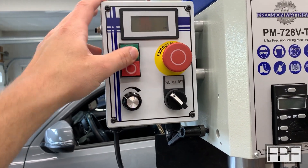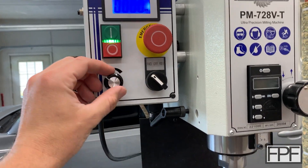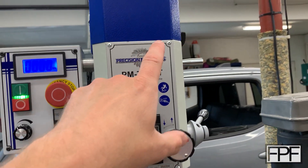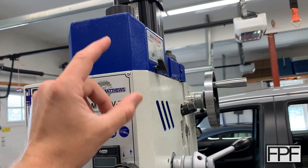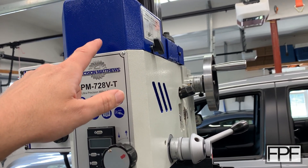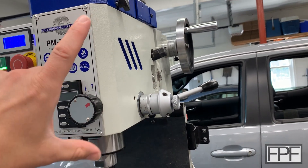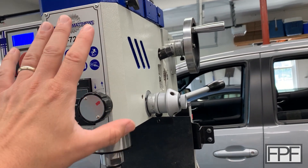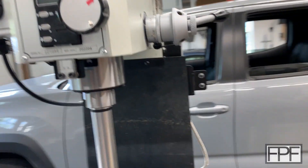We'll close this so the safety disengages and get this to just barely turn. Worth noting that any inaccuracy in the dimensions of the pulley, or if the belt has a spot where it's bent a little bit, could be pulling on the spindle and causing inaccuracy. But I can't think of another way to turn this — even turning by hand puts more force on the head versus any inaccuracy caused by the belt. I am turning it with a loosely tightened belt with plenty of slack. But take a look at this.